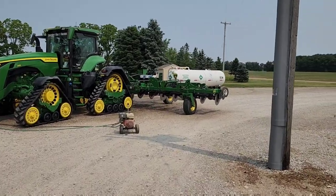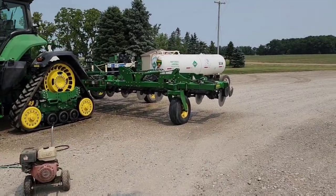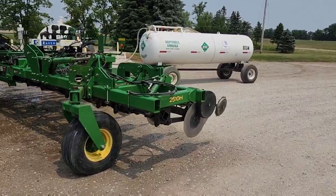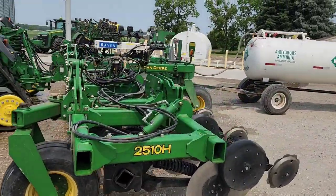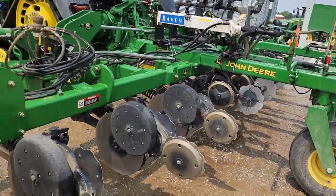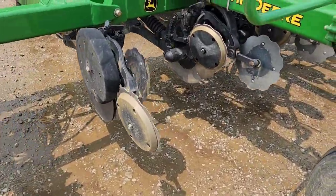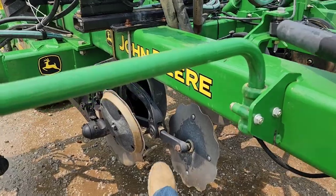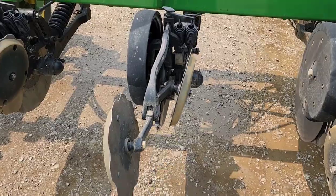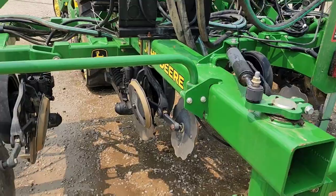All right, well, we got back to the farm here. Ate lunch. Brock got on with our concrete, and we're not done with this, but we had that oil leak. It made the bar really dirty, and so he wanted to wash some of that dirt off. This is a good idea. I wanted to do a little bit of maintenance on this today, like that beaver tail right there that's getting more worn because it's right behind a track. Move it, so maybe here where this one's not as worn, just to keep those doing as best a job sealing as we can.